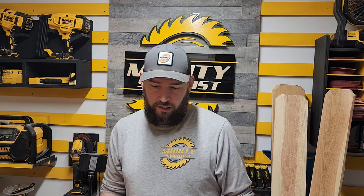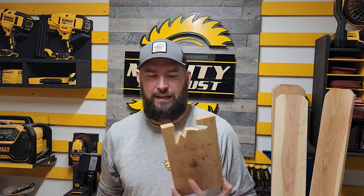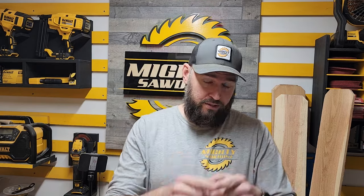It also depends on your design. If you have more curves I guess you could use the jigsaw, but in my experience the scroll saw was a little bit easier even though there are some mishaps from time to time. It's a very thin blade — you can get those curves with nice tight edges. It's all up to you and how you do this process.